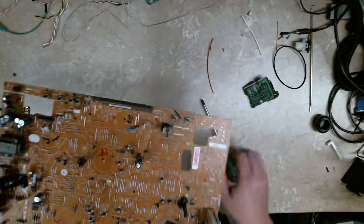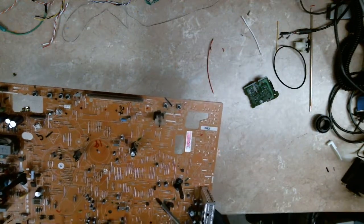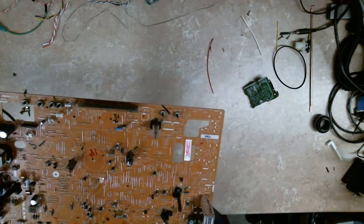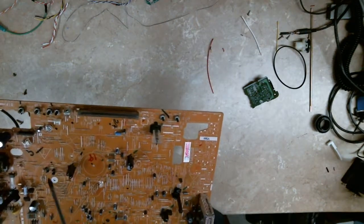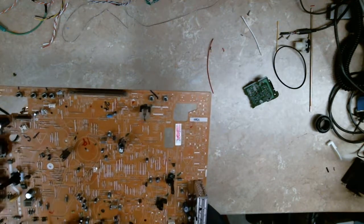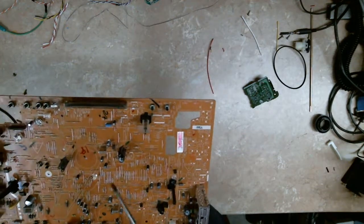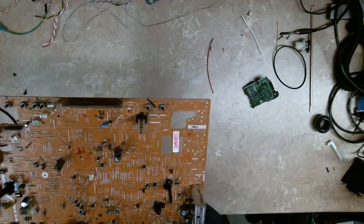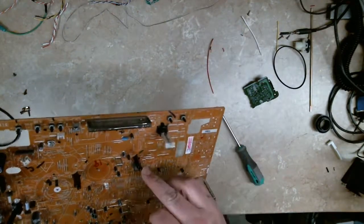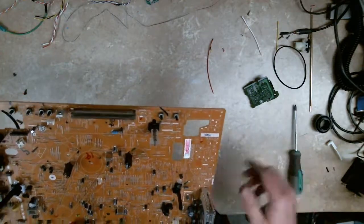But nonetheless, this board is filled with interrupters. I mean, that's all VCRs are, photo interrupters. There's one here and here, and they just look like little black specks. Here's two. They're everywhere on this board, and those are so useful. So salvage those. Be very gentle with them. The plastic stalks they're mounted on are fragile. They'll be labeled diodes, so look for black plastic forks that are labeled as diodes.